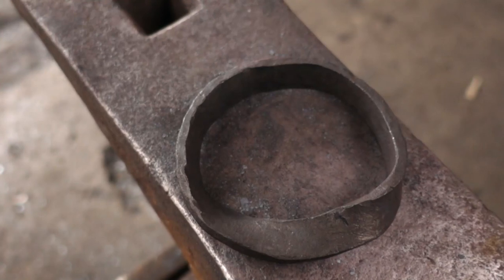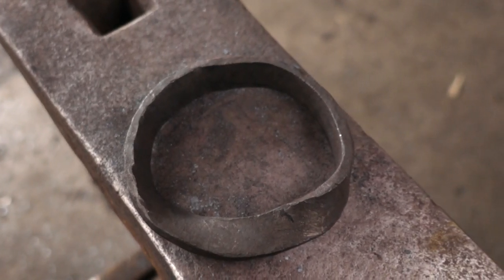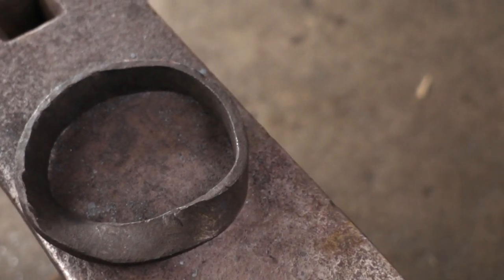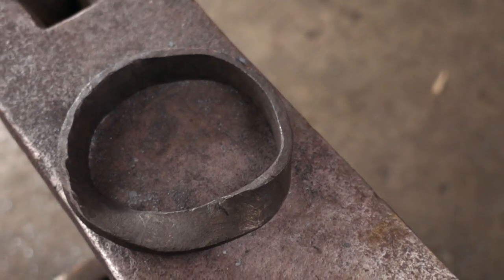This is really hard to do. Because of the twist — that 180 degree twist — you then have no flat spots, and so it's really hard to bend it into that loop. I was fiddling with this off camera for quite a while, and it's one of those things that I imagine I could fiddle with for hours and just gradually make the shape worse and worse. But in doing the forge weld, we create a flat spot, and so that flat spot pushes the twist over to the other side and it becomes very uneven. It was really hard then to try and sort that out, because you can't clamp it in a vice or anything, and so trying to put the twist back on on the other side is really hard.